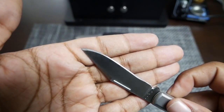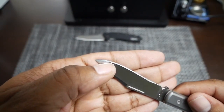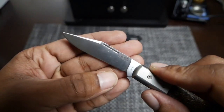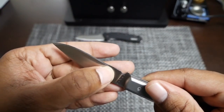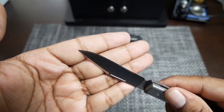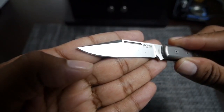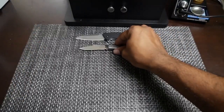Also look at this sharpening — this one does look better than the other knife. You can clearly tell by how large this bevel is here and how much relatively smaller the bevel is on the other side that there's clearly a difference in the angle. It looks like they got pretty much to the back of the knife on one side, but on the other side it looks like they just ran way up onto the blade and didn't get back here. So this sharpening is incredibly uneven. It looks like there's a wire edge on these knives — you guys tell me if that's my eyes or not.